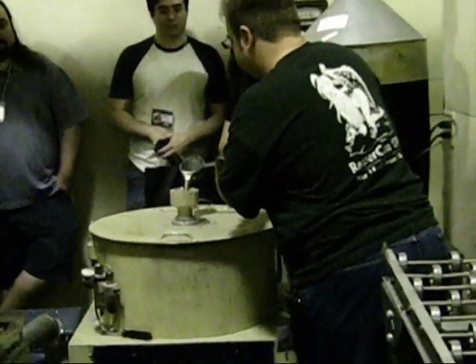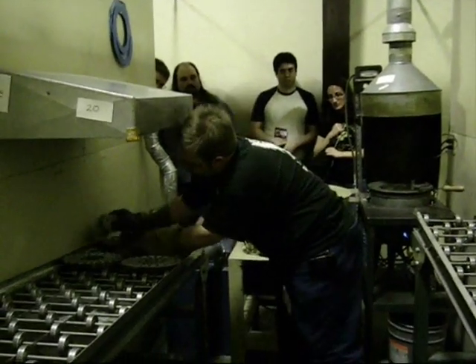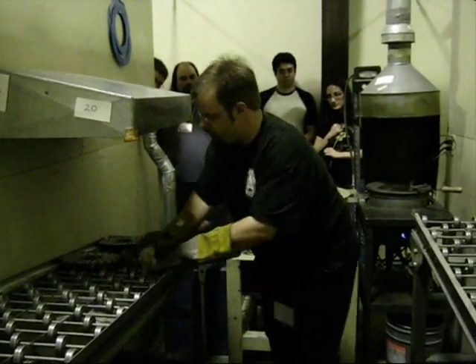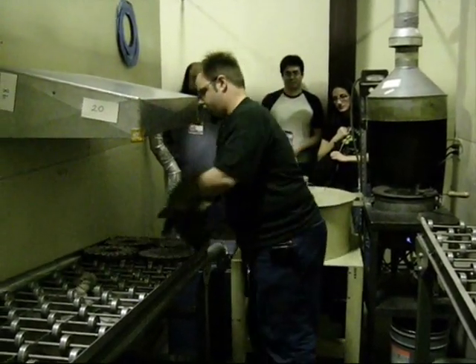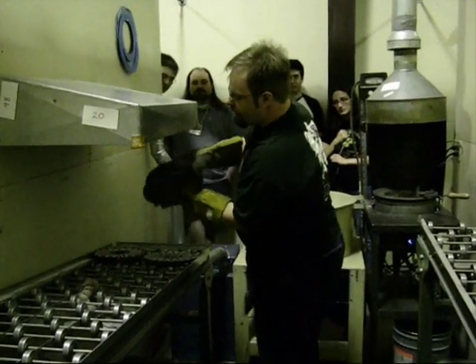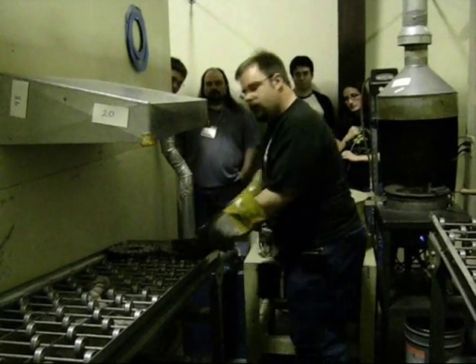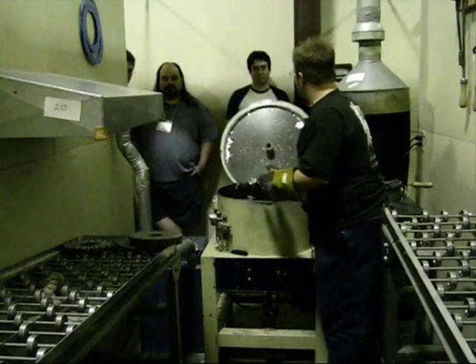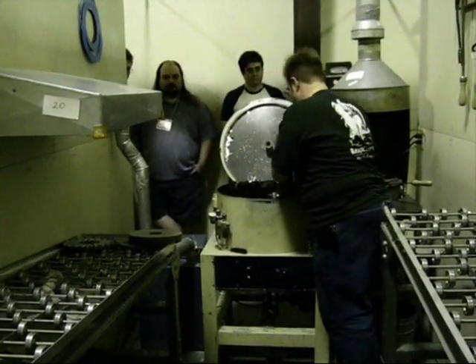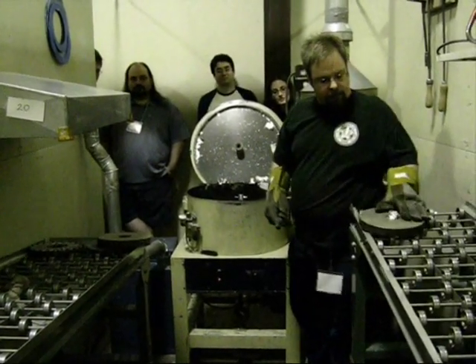I'll just pour that right in there. We'll give it about 10 to 15 seconds and that'll be enough time for that to cool off. I'll clap these together to knock off all of the excess powder. The talc will burn — a small layer of talc won't, but if there's a large clump of talc that got deposited somewhere on that mold, that'll burn and you'll get a brown spot. It may or may not texture the mold, but it's just not pretty in the package.